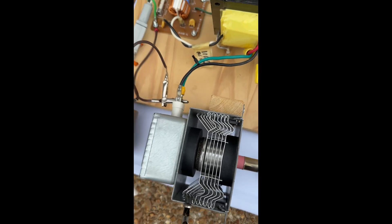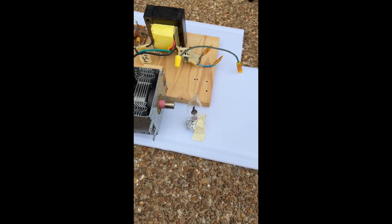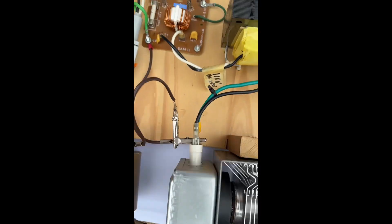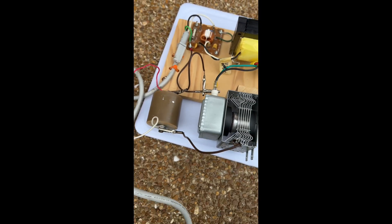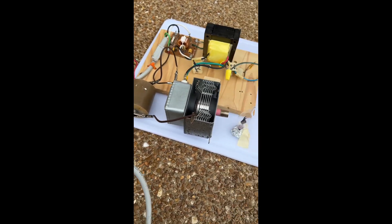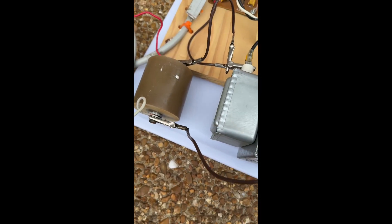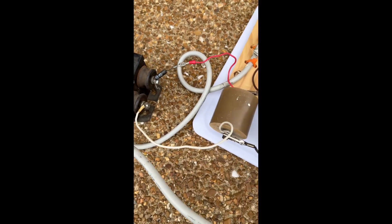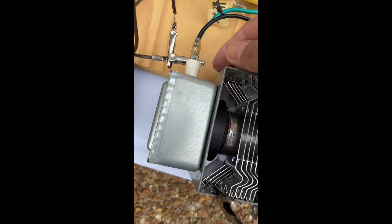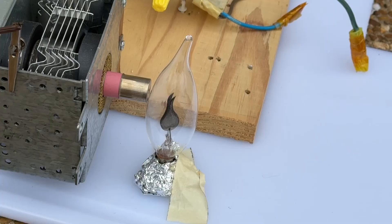What I'm going to do is activate this thing with me inside the garage and photograph that bulb just to demonstrate the output of the microwave energy. I've got a bunch of mains filters here for protecting the house mains — those are typically found inside a microwave oven anyway. So here's your setup: transformer for your filament, your neon sign transformer connected to a Variac for your high voltage, putting about 4,000 volts in there and three volts across the filament. The cathode is negative and the anode which is the casing is positive. Okay, here goes — I'm increasing the voltage on the Variac up to 80 volts.